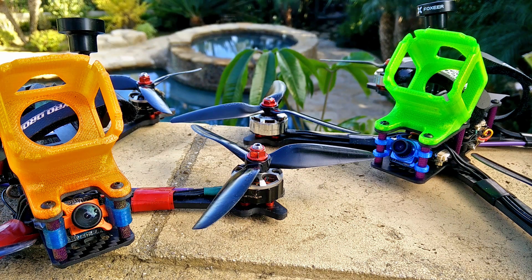It's going to be quieter because, number one, the props you use will probably have a little better vortex control and won't be so zippy through the air at the tips, unlike the Phantom's bullnose square tip. Number two, the quad you build will probably have a better disc-loading property than a Phantom, which doesn't care at all because it's got so many gizmos on board that it just flies no matter what. Lighter quads are generally quieter because the props are spinning slower — and that's a very important concept.